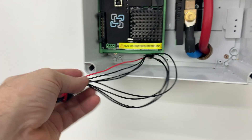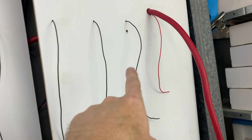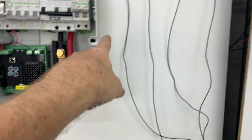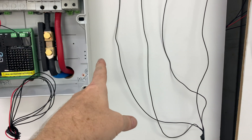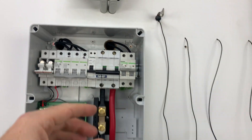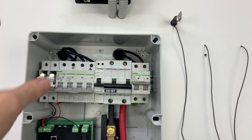We've got the balance leads coming through here — we've got eight of them, so four there and four up there, with the most positive out there coming with the positive cable. The positive cable is way too long; I was planning on doing equal lengths. There's about half a meter of the blue cable — the negative — behind the wall, just in case I ever have to move it, plus a little bit of extra of each cable for moving stuff around.